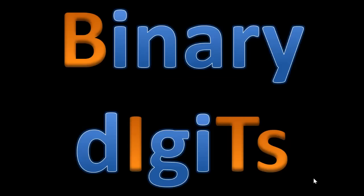Okay, binary digits, B-I-T-S, bits. That's where that term comes from. A bit is one position in a binary value. A nibble is 4, 8 bits is a byte, 16 bits is a word, 32 bits is either a double integer or a long word, and so forth.